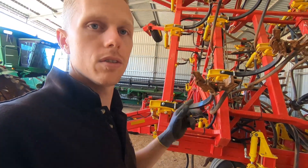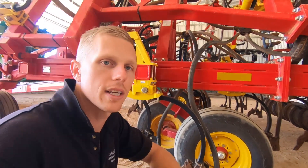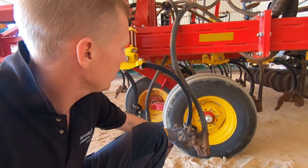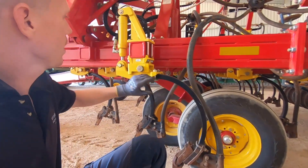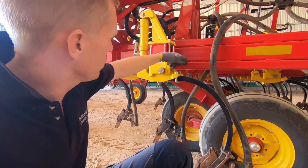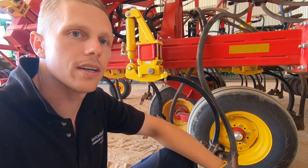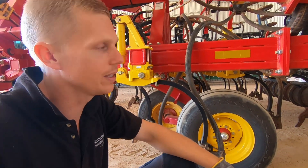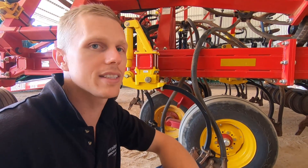As I said earlier, this cultivator is brand new from last year, so there shouldn't be much maintenance to do, but it's just fiddly annoying stuff. As you use it, things wear in and settle. I'm going to go over all the u-bolts and bolts down the bottom, make sure everything's tight, check the top pivot bolts, and then give everything a shot of grease. There are about 45 tines to do so it's going to be very repetitive — I'm going to have sore, dusty knees by the end of the day.